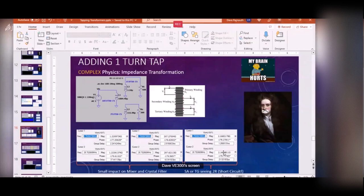However, looking at the impedance at the tap itself - it's 2 ohms. You've got a 50 ohm device connected to a 2 ohm impedance - that's basically a short circuit. If your tracking generator is connected there, it's seeing a 2 ohm load. 50 ohms feeding 2 ohms is essentially a short, so using a one-turn tap for your tracking generator input is not a good idea.